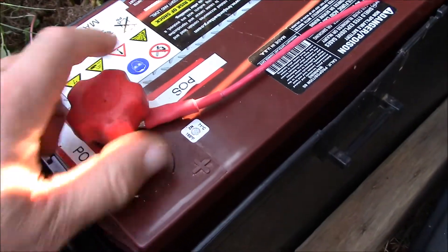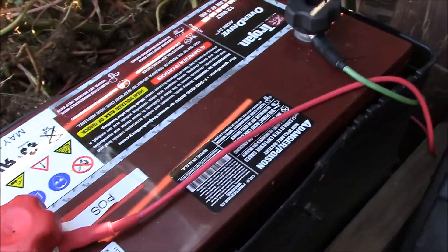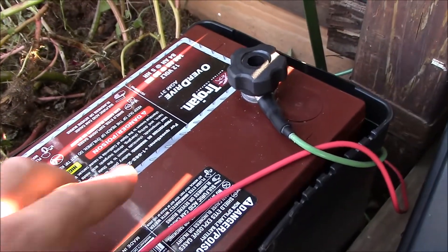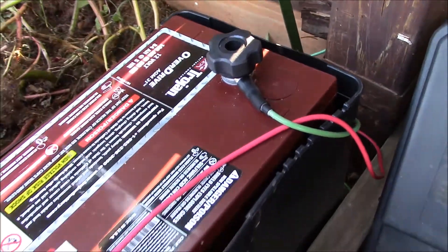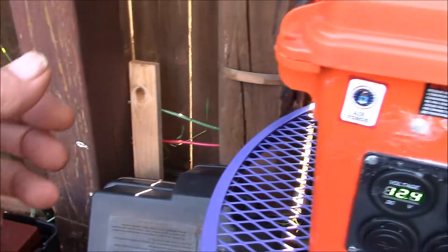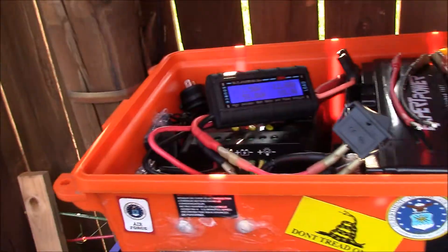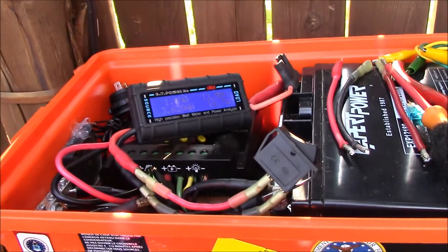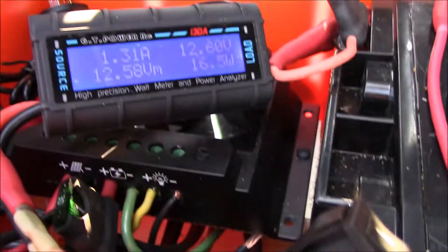Put it in a battery box with some pavers underneath there for stability. I'm using 10 AWG THHN RoHS wire that I had laying around with some tinned battery lug ends, and also tinned the ends going into the solar charge controller — I'll show you here in a second. Just disconnected the batteries that are in there; that's my meter for the solar panels.